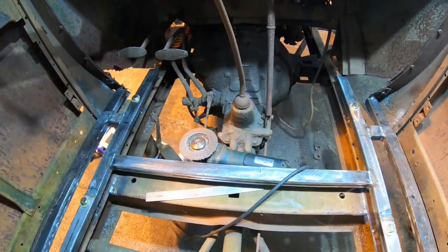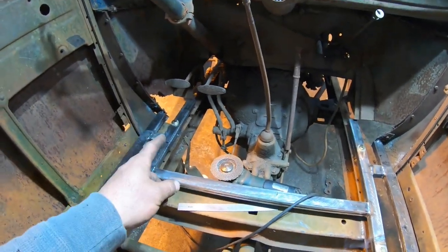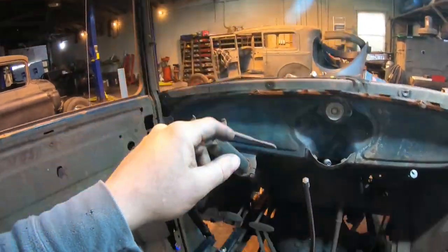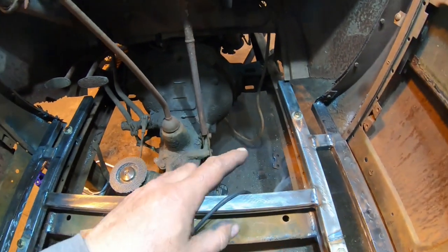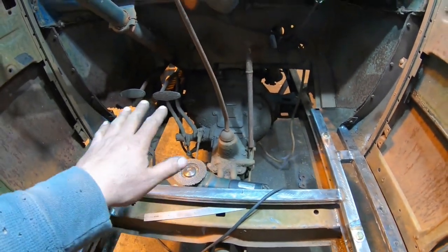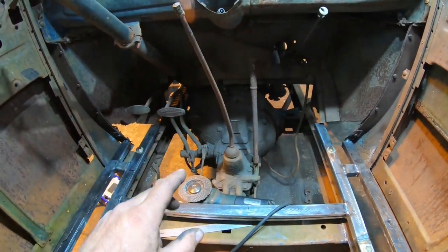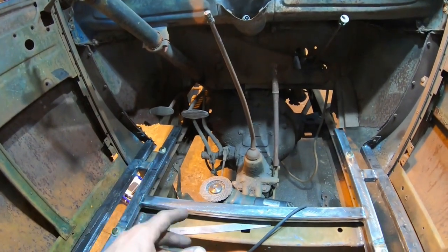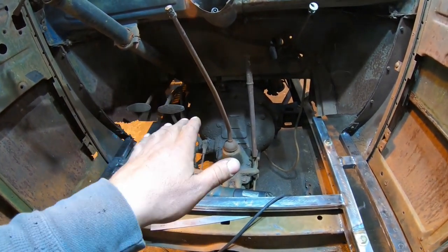So at this point, I got that bar taken out that was holding the body up. We are exactly the same off this structure up to the dashboard, both sides, as well as the header panel up top. And I got some pretty good welds going on both of those pieces of iron. So we are locked front to back the same distance on each side to locations on the chassis. We are locked side to side centered and our height is good. So now that's basically a really good starting point. I mean, we're pretty much set there.